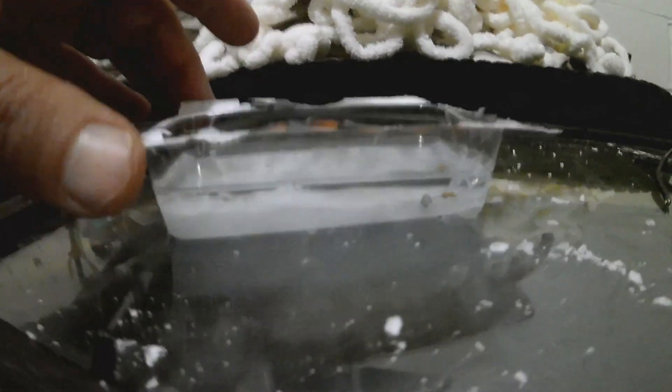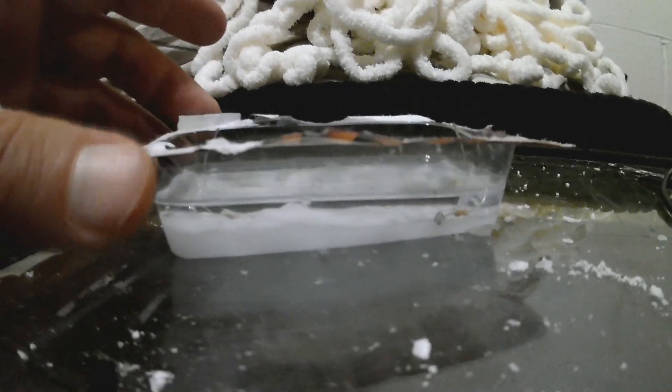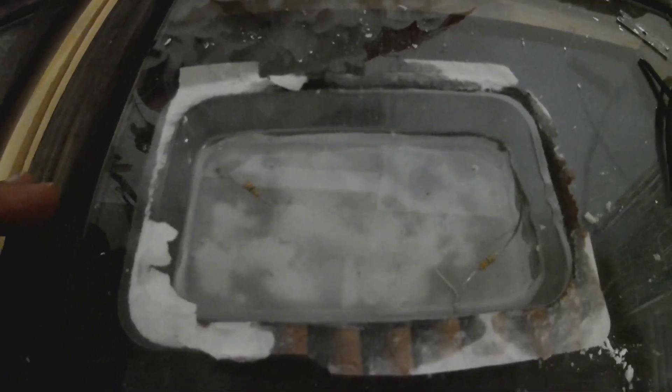Looks like I melted the whole surface and it's looking pretty good. Let's let it cool off for a little while and then we'll test out our resistors. The container still hasn't failed yet. You can see a clear layer of liquid in there — wax becomes clear and fluid-like. I'll let that harden for a bit. I chose paraffin because it's going to be a little bit more solid than the Vaseline, and it has good electrical properties as well for high voltage.